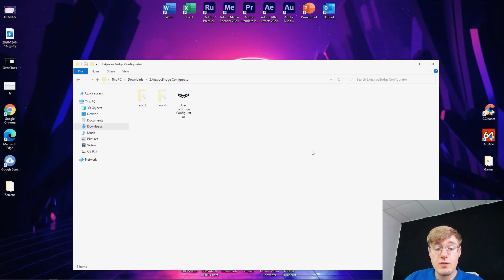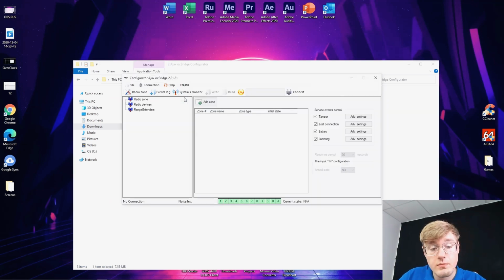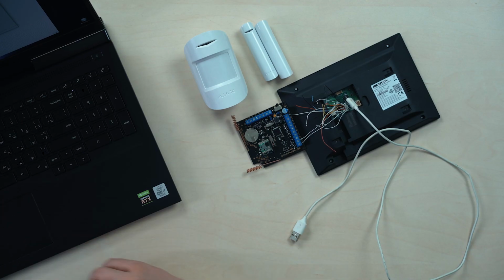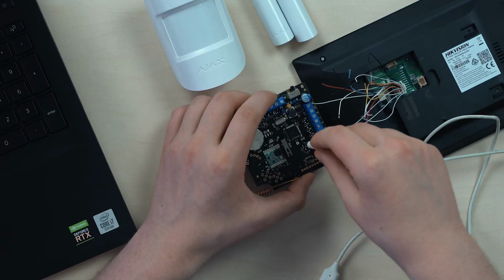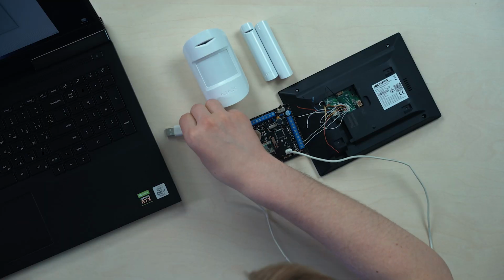First up, we download the ocBridge configurator tool and the drivers for it. You'll find all the links in the description. So install the driver, and regarding the configurator, choose the full installation or the portable version like I did, and then run it. Now we connect a mini USB to the bridge, and the other cable end to the computer.